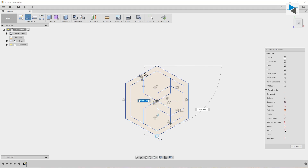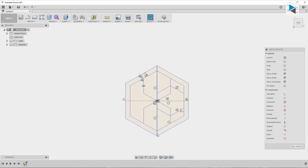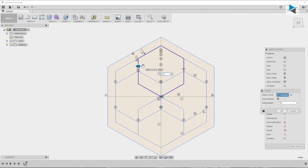Using the line tool again, a vertical line is placed in the center of the sketch. The polygon feature is mirrored using the mirroring tool with the previously constructed line as the center reference. Thickness is then set to the inner geometry using the offset tool.